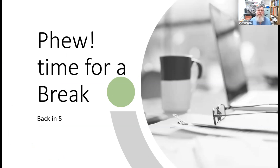That's a good question. No, we haven't used it for predictive maintenance, but it could be used to help with predictive maintenance, in the sense that we log the times that the machines have been run for, and if the downtime is excessive on a machine, you can say that machine looks as if something's going wrong. Often people talk about predictive maintenance in terms of vibration analysis. Now, if you're looking at vibration, that's actually a bit too late down the line. There are more complex systems that look at oil quality, for example, on an ongoing basis, and can report those things. But the integration to a CMMS would be something simple in terms of just logging of timings, in this smart enough approach.